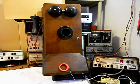We rewired this unit the way we wanted it wired to work the way we want it to work. We utilized some of the original wiring. We wanted to incorporate some of the original wiring for this telephone into our design. We installed a keypad in the battery box area. We also installed a modular port, a line port, so that Robert can simply bring in any length line cord, any color he chooses, plug right into the modular port. Makes for a simple, easy plug-and-play connection.